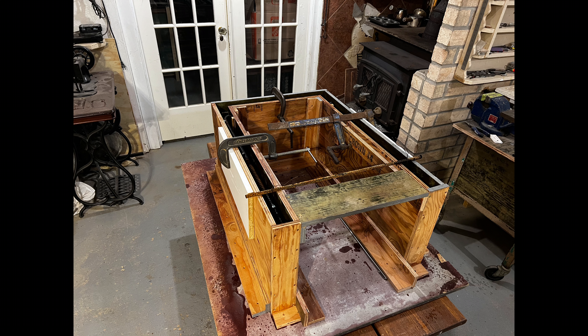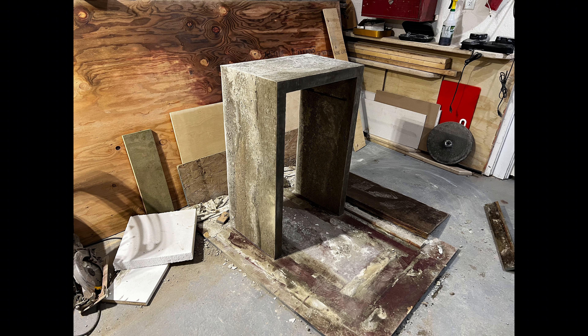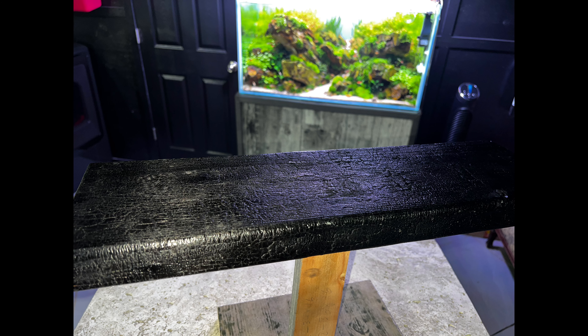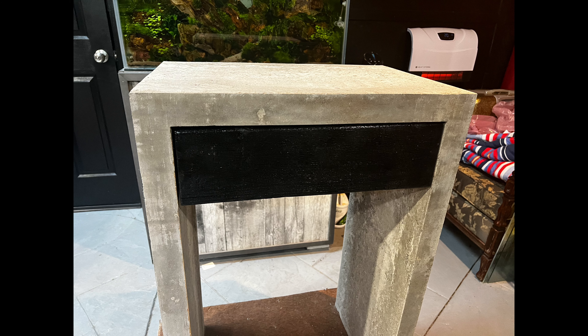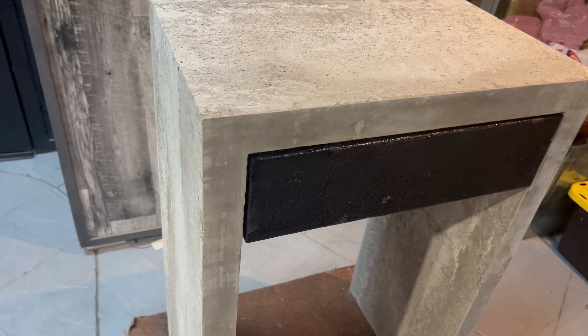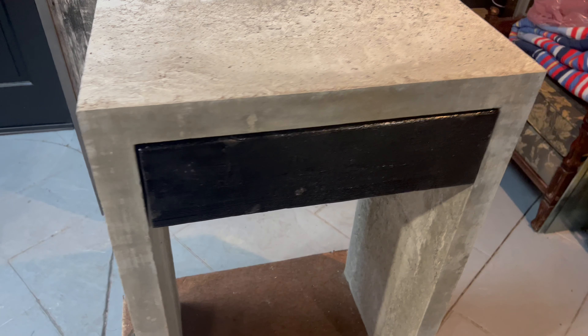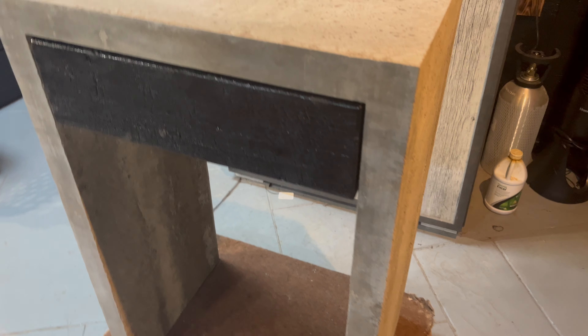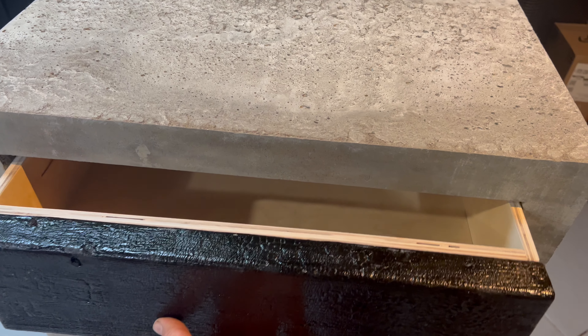Here's how I started the forms — I used 20-mil plywood, and reinforced the concrete with 15M rebar and 10M rebar. Here it is with all the forms closed, squared with clamps. This is right when I pulled it out of the forms. I kept that raw look — I could have sanded it and patched little gaps, but I didn't want to. This is the face of the drawer that I torched and used polyurethane just to give it a cleaner look so it won't make your fingers black.